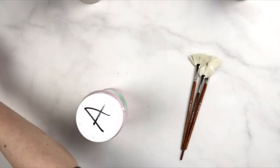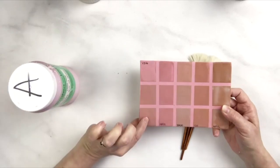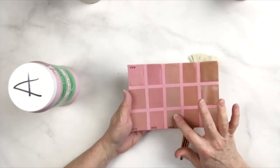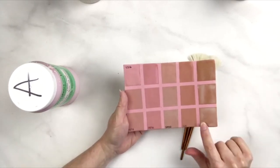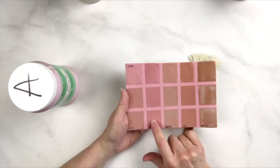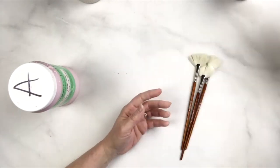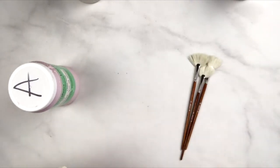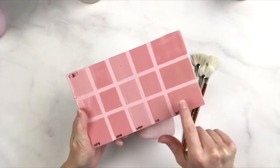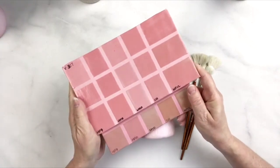Here is V316 Light Pink — HF9 is a little more brown, HF10 actually looks pretty good. SM10 without zinc is a little bit brownish, as is the Mixing Clear, and HF12 has a very beige undertone. What I used to say is 'pink likes zinc' — the old chromium pink did better with the presence of zinc than without. So we created V317 Coral, and now regardless of whether you are using zinc or zinc free, you get the same bright pink all across the board. Isn't that nice?